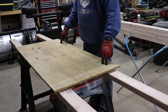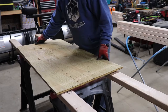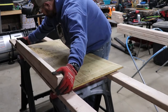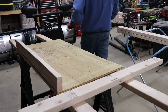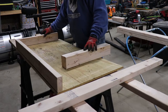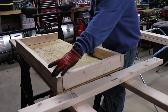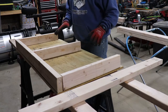So this is our platform — it's a two-by-four piece of plywood. This will be the top where they stand on. I want the nicest part facing up, so this will be the bottom. I'm gonna use this to set up my two-by-four frame. We're gonna take two four-footers and our cross members here. By cutting these 20 and three-quarters, when you put your other two-by-four on, this will make from the outside to the outside two feet. We're just gonna have one cross member in the middle — that will be plenty enough to hold a goat or a sheep.